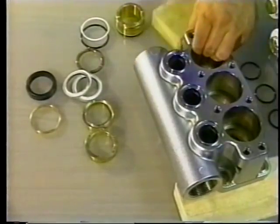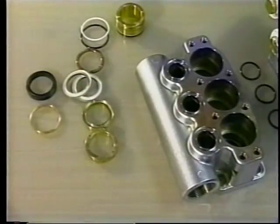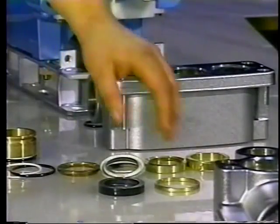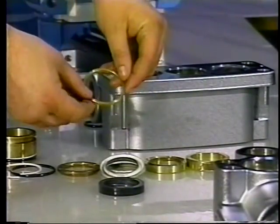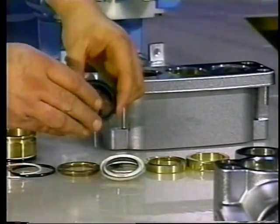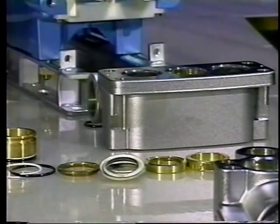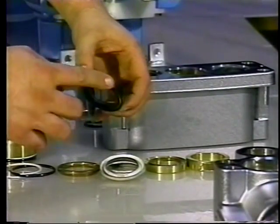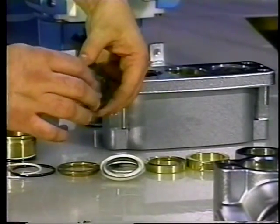Remove the blocks and invert the inlet manifold, placing the crankcase side up. Examine the washer for scale buildup and clean as needed. Insert the washer into the inlet manifold chamber. Examine the low pressure seal for wear or spring fatigue and replace. Apply liquid gasket to the outer surface of the low pressure seal and insert with the garter spring down into the manifold chamber.